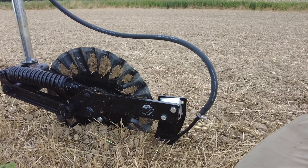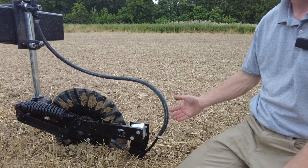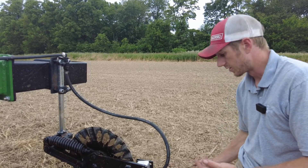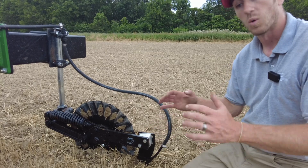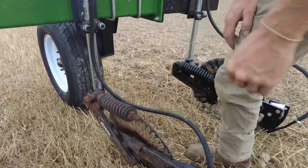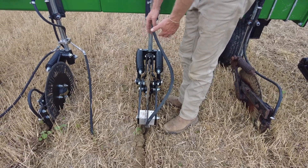What does depth equate to? Depth can equate to many things. Beck's is doing a lot of studies on depth placement of side dress — not only are we breaking up some of that hard soil underneath and allowing oxygen into those roots, but we're putting it down there where it's going to stay. So this is the Yetter 2996, a single arm coulter. This is the true trail design — that is going the deepest and it's the unit built for longevity.